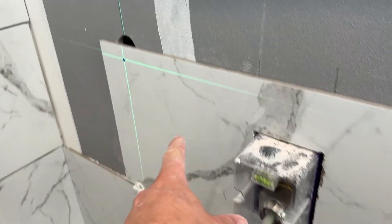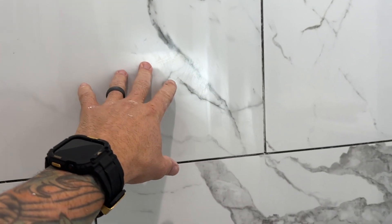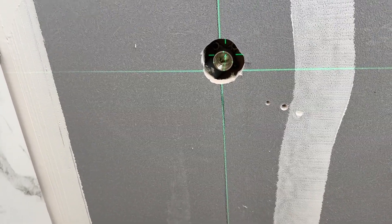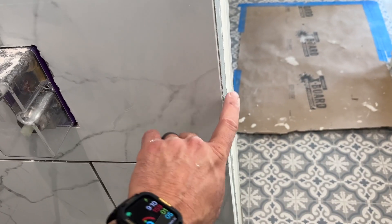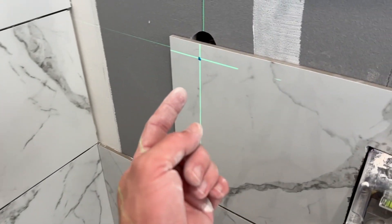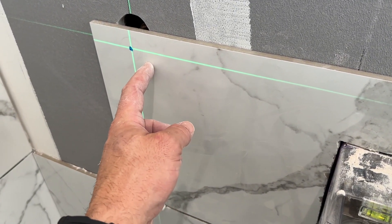Right here we have a wand that will come out for the shower, and we can do the same thing up here where we have shower heads that are going to be sitting possibly somewhere in the middle of one of these tiles. It's really easy — you can take your laser level, square it up on your fitting so I have it centered there. Then I'll dry fit this tile and now I have my center marked. I'll put my spacers in and make sure everything is lined up. Because I have this laser level sitting center over my fitting behind the wall, I can mark my center and also mark the outer perimeter of your hole saw if you want.